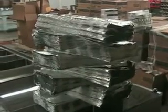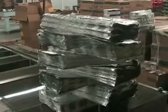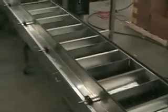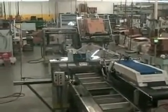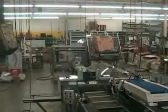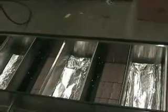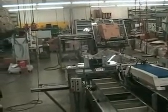This is a cartoning and case packing system for the packaging of aluminum foil interleaved sheets. The system consists of a bucket conveyor, intermittent motion Spartan cartoner, an in-feed system, and automatic collating and case packing, all integrated into one complete system. From the time foil sheets are placed into this bucket conveyor, the operation is operator-free until a finished master case is ready for palletizing.